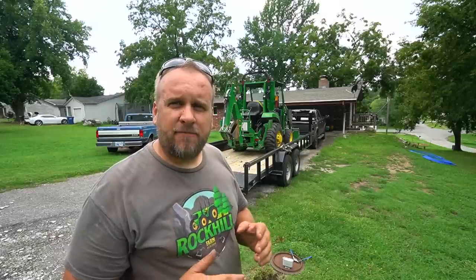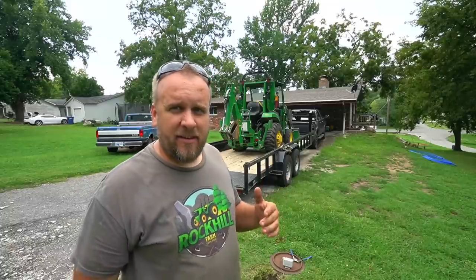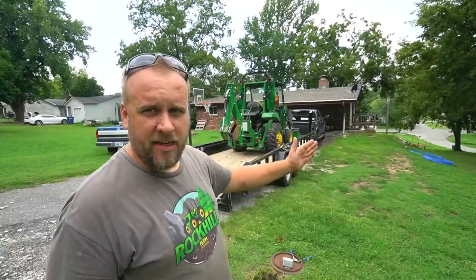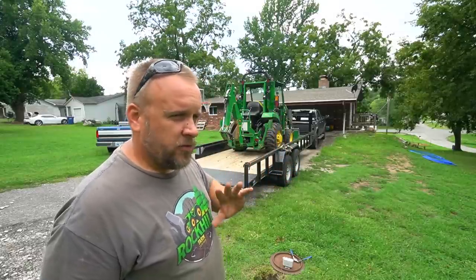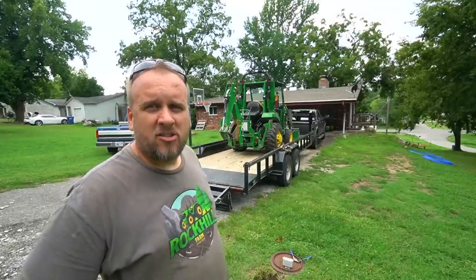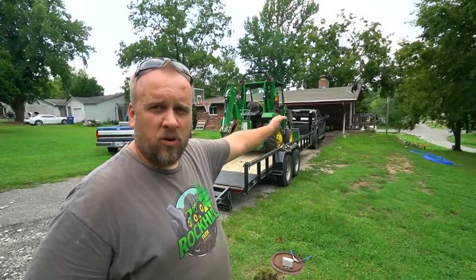This is my daughter's house. A couple weeks ago they noticed that their water bill went crazy and it's getting worse and worse. We've isolated the leak by shutting off everything inside the house right where it comes in. We put a ball valve right where it comes in and we know no water is being used inside, but the meter is saying four gallons per minute. So we know for a fact that it's right here in this stretch to the corner of the house.